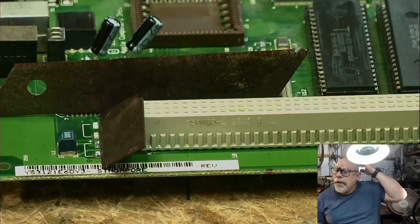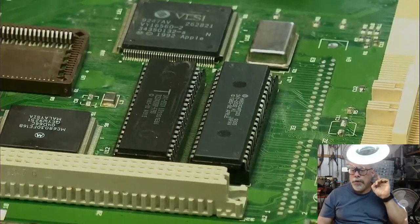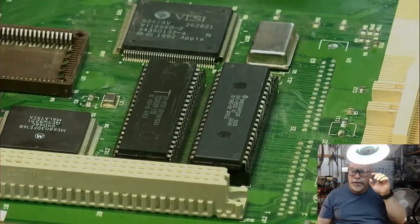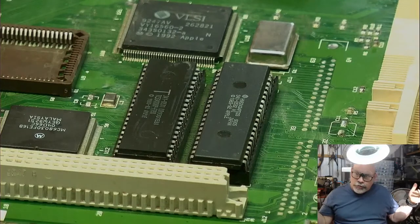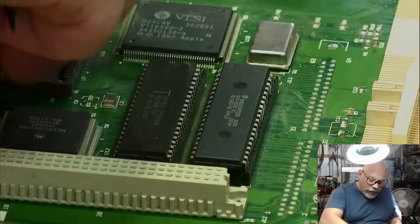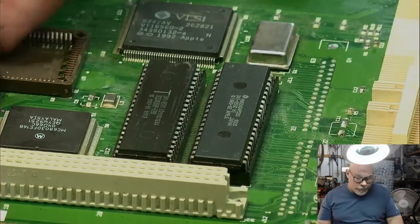Dan, has he tried to power this machine up? He has. He sure has. We got no chime. We got grey screen. We didn't get cursor. We didn't get flashing question mark or anything like that. And the power switch didn't switch on the first time, but it did when I pressed the restart. And, you know, sort of a hard restart, or is it a soft restart? Anyhow, did it on the keyboard. Yeah, and this pretty much fits what the customer said about the board. They said that it does work sometimes and doesn't work other times. This was one of the other times.